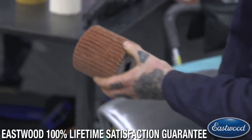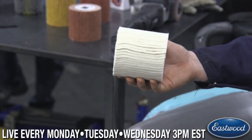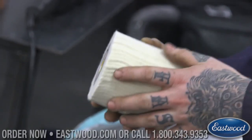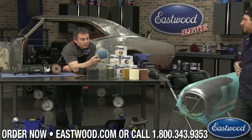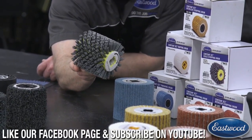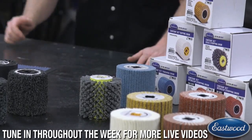Or if you want to buff your panel — if you have an aluminum body vehicle and you want to buff something up or a large piece, you can use this to buff up a large area very quickly. We showed earlier the 320 grit for aluminum and softer metals. And then this one here — sort of like a wire brush — is going to be great for heavy rust or around edges and bolts, because it's going to help remove it without nicking and cutting your drum, which can happen around sharp edges.